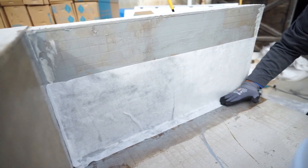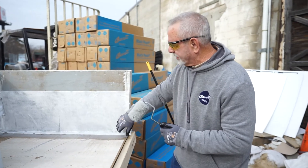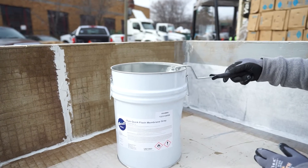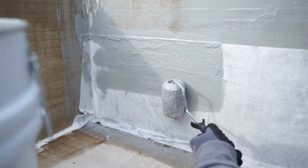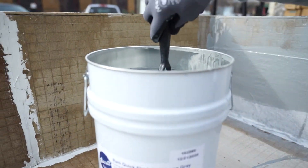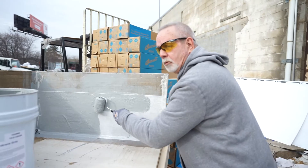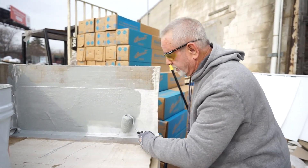The fleece has been installed — it's nice and tight to the wall. I am now going to add my second coat of resin. Remember, we're going to start at the top so that we can control the flow rate. This fleece will suck up the resin, so you're going to have to go back into the bucket and get some more. We don't want to be bashful — we want to make sure we get 100% coverage, but at the same time we don't want to overdo it. You know you have the right coverage when you can't see the white fleece.